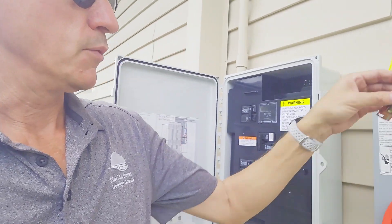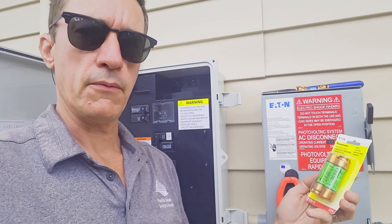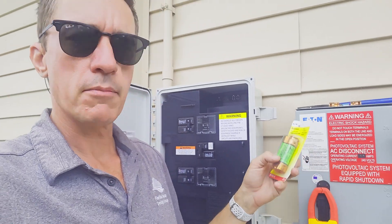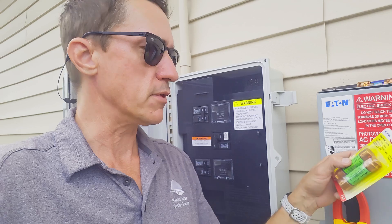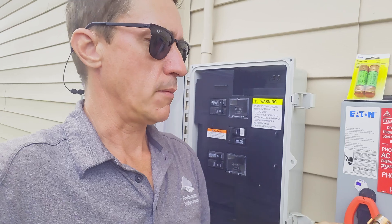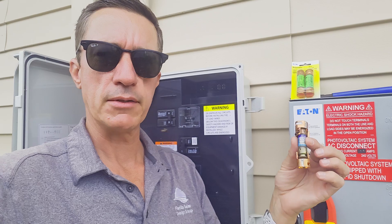And that's the source of the issue. It really was unnecessary to use the fuse holders. If this was designed to use a different fuse — like I'm going to pop these 35 amp fuses in here and everything's going to be fine. The wires are actually substantial enough for a 60 amp fuse here, so I can use anywhere from a 35 to a 60 amp fuse in this fusible disconnect and still be code compliant. So anytime you have an opportunity to use a regular size fuse versus a fuse reducer, you might as well go full size.